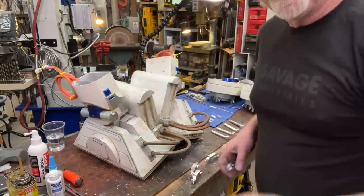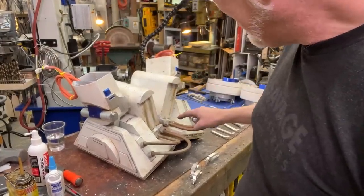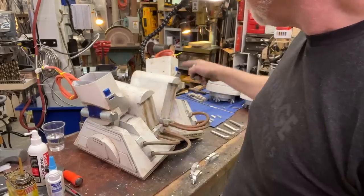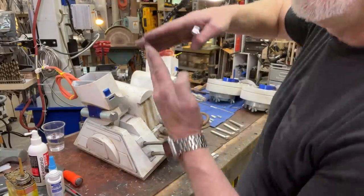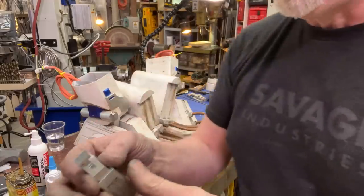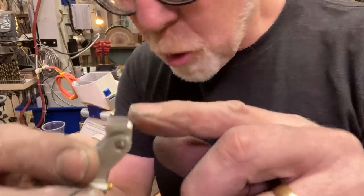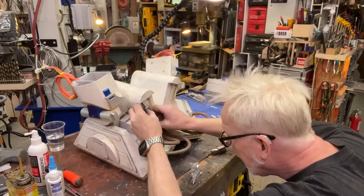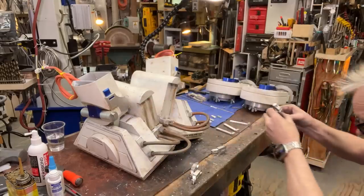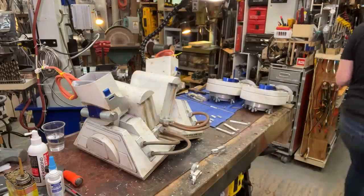It's worth talking about what I mean by soften. The backs of these, this is a piece of bent aluminum that does that. And it's welded to a piece of aluminum that's wrapped around like that with two end cap pieces and a back cap. And that means that in here, the join is not super sharp. So when I say soften the back, I specifically mean just take a little bit of relief off the corner there so that this can sit all the way back in there and have its orientation be regular. That's good. Yeah? Am I happy with that? That's good. Yes. All right, we're gonna clamp that.